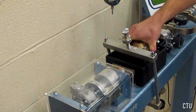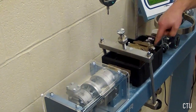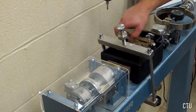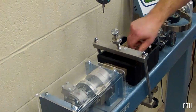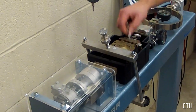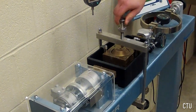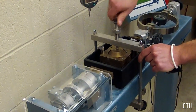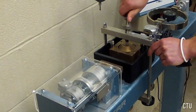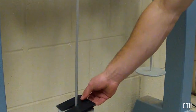Insert the shear box specimen into the loading machine. Place the loading cap and frame without weights on the sample. Take the construction screws out, gap the sample, add weights to the loading frame, and then ungap the sample.